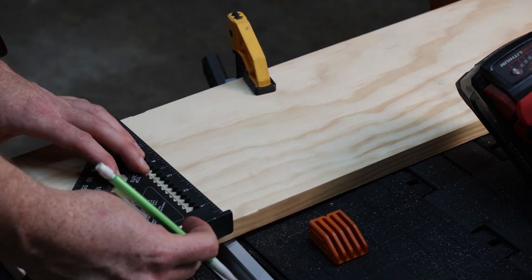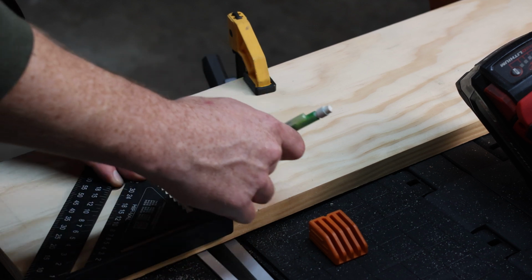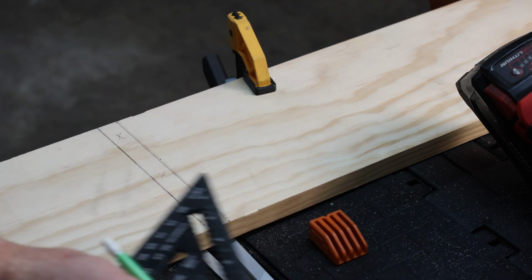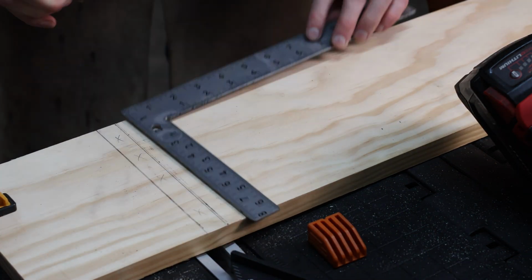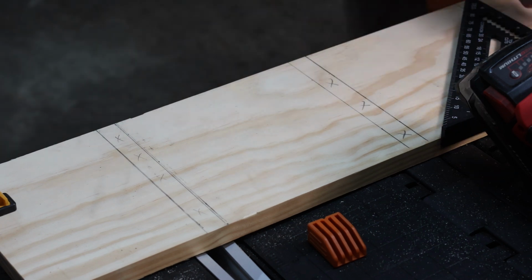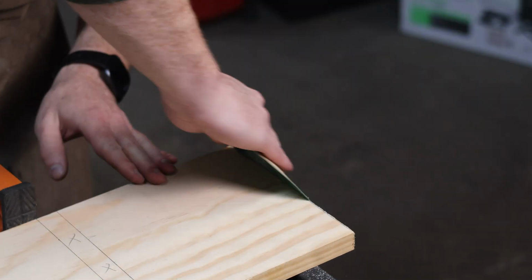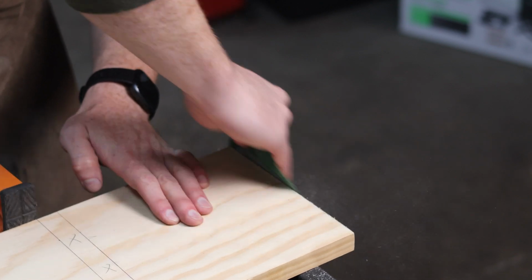The age-old adage of measure twice, cut once is definitely a real thing. Nope. There we go. That looks more like 3/4 of an inch. This is the first time I'm using a router, so wish me luck. I'm going to be cutting out dados about 1/2 inch, maybe 3/8 inch deep, so that I can seat a shelf in each of these dados. There's going to be 3 shelves, and the end of each shelf is going to have a nice little decorative horseshoe screwed into the end of them, and then a towel will sit on top of each one.